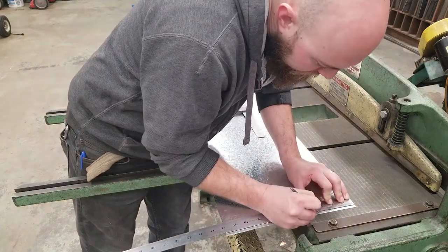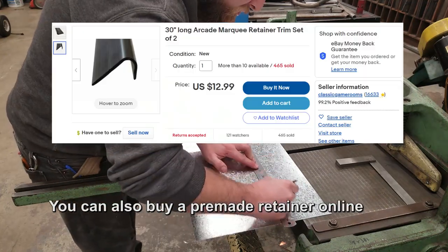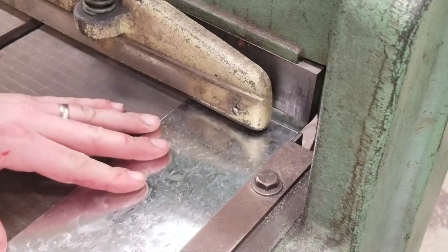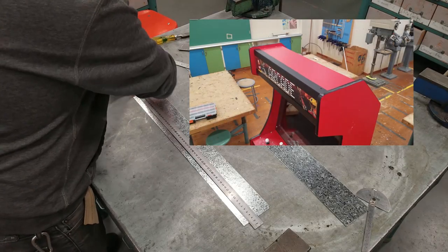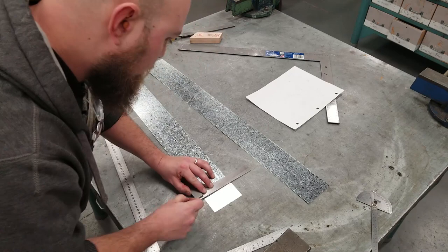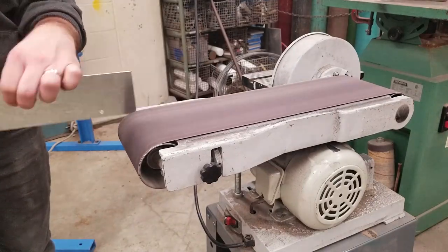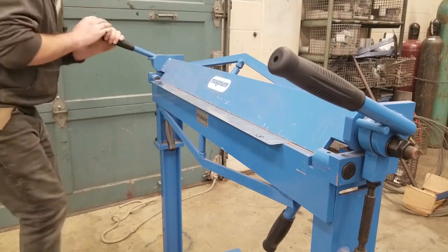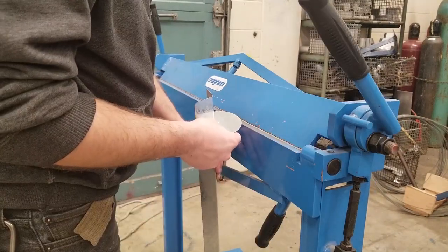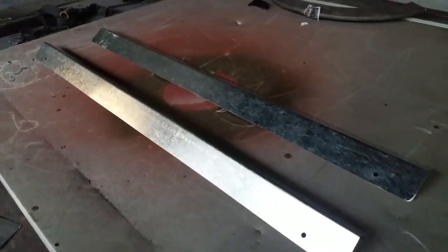In the past I have used angle iron to hold on my upper marquee — that's the cool part with the artwork. I decided to make my own out of some sheet metal. This is just some 22 gauge galvanized. Because I have access to it, I made my own. It's very simple — rectangles, bend a little bit, drill some holes. Just like everything else in this project, I am customizing every single piece. That's kind of a curse, but it's so much fun to make these. Paint time.